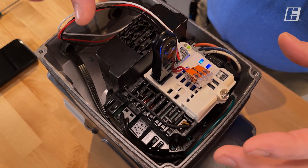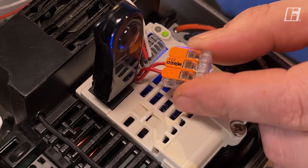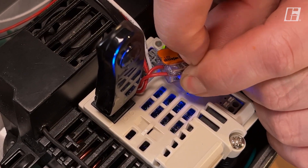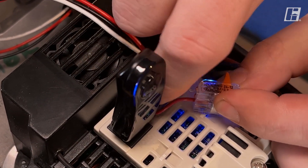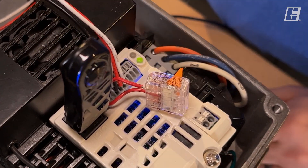Now one more step at the drive — we need to disable the drive. That jumper from terminal 1 to 2, we just need to break that connection. Our drive is now disabled and our Bluetooth radio is enabled.